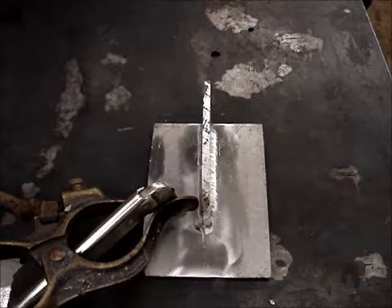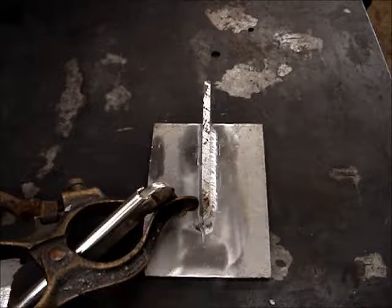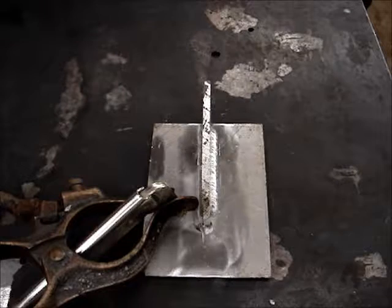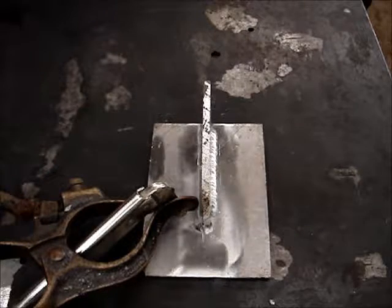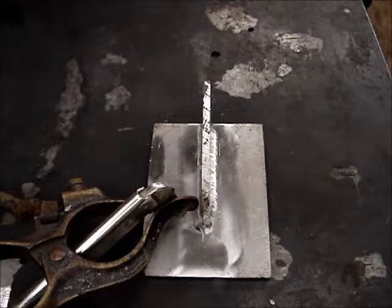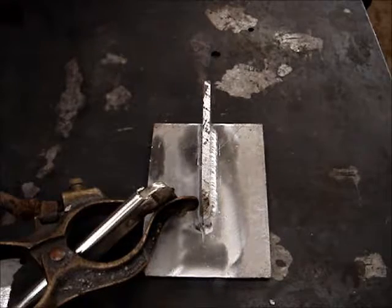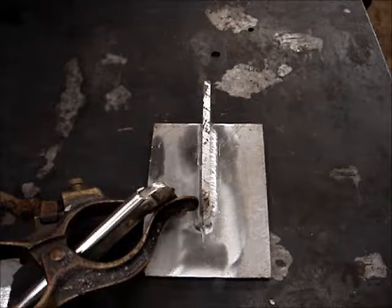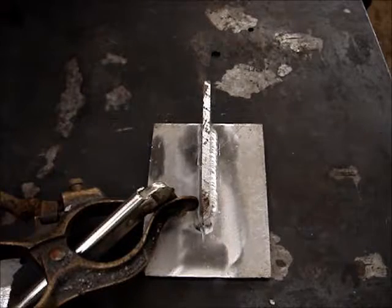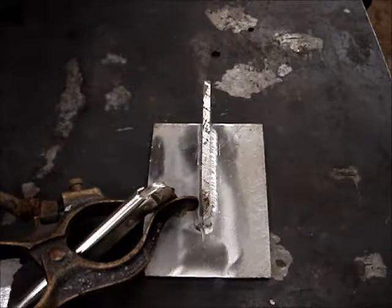Then you've got white metals, which is another one. You got to be real gentle and careful with that. You can weld some of that. Some of it you can't. Then you've got cast versus forged type aluminum. Forged is always the best. I mean, it's pressure put together. It's clean. It's really good. There's not a lot of porosity in it. It welds really awesome. When you get to cast, some of it, depending upon what it is, you can weld. Some of it just keeps cracking. So there's a lot of situations out there that no matter what you do or how good you are, you're not going to be able to repair it. Sometimes that's just the way that it is.